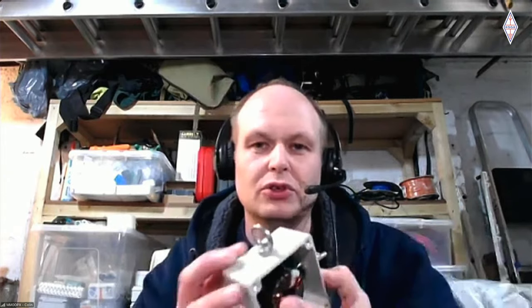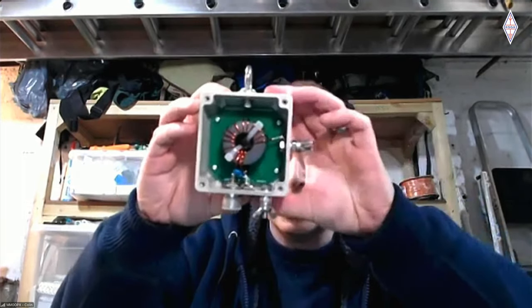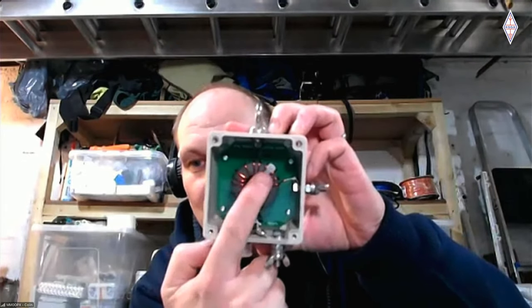A lot of people do this basically to suit where you actually want to have your antenna point connection. You could just wind the wire continually around the core if you want to. I've done that in experiments; they call that the crossover. So it doesn't really matter as long as it goes through it. As I say, I've done both. You can do it either way, but depending on your transformer and what you end up with, you can see that I've got my antenna connection here. So I don't actually have a crossover here. You can see that I've just started winding, and it just goes all the one way.